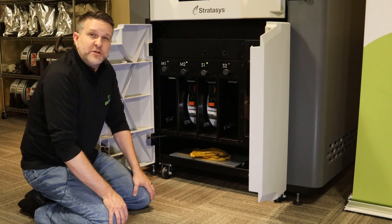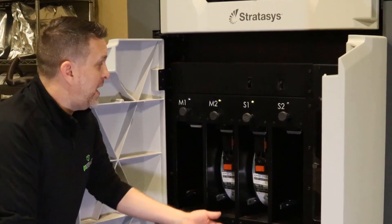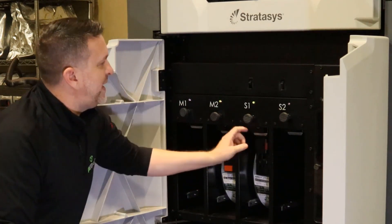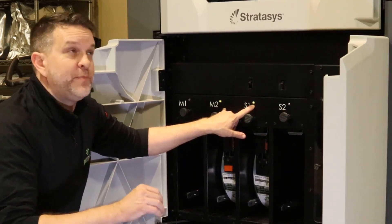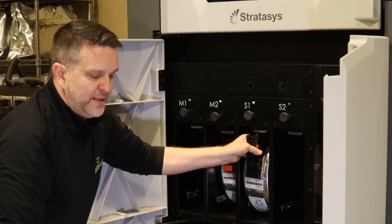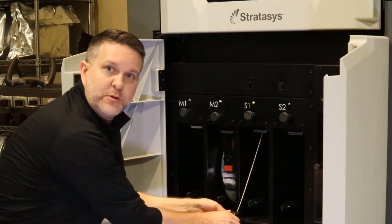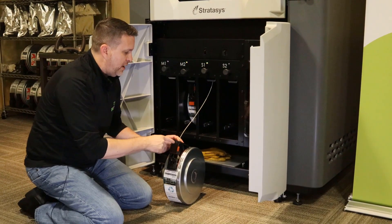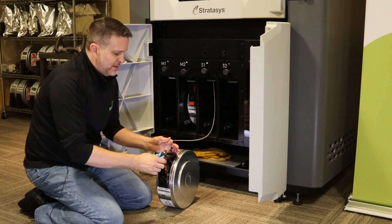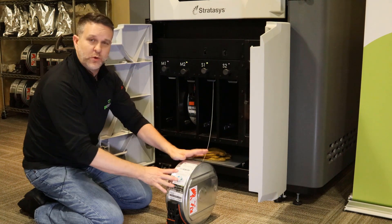The screen has now told me that the material has been unloaded from the head. In order to get this canister out and clear that line from all that material, we need to remove this canister completely. We open this door, put in the brake, and close the door. Fast flashing green means it's doing something, but according to the screen it says it has been unloaded, so it's okay for us to take this out. We push up on the drive block and start pulling this out slowly, because it's gently feeding the material. We need to push up and slowly start pulling that canister out right away — once done, clip off the material from the canister, take the plug, and put it back on the top.